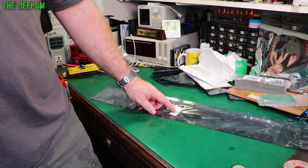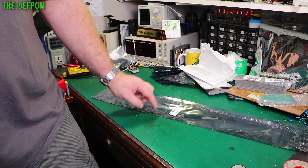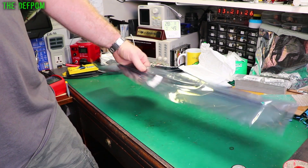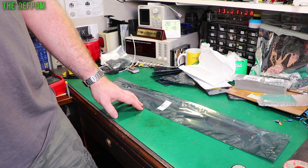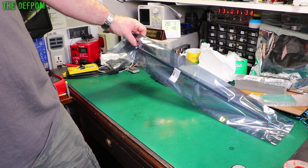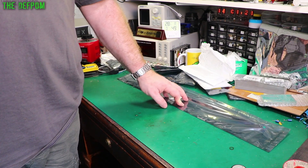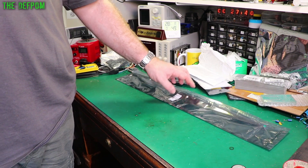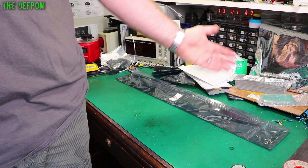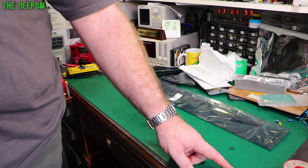So these are SN74LS273N — these are D-type flip-flops. 25 of them in there in a tube. It's a bit unwieldy but I'll probably cut that up into more manageable pieces. Again these are for the Marconi — they're part of that AF circuitry, and they're quite commonly used in other things too. So I got some whilst I could. These through-hole parts are getting a bit of a problem to find these days.